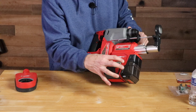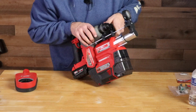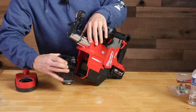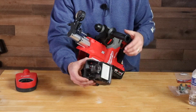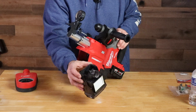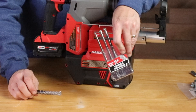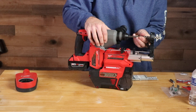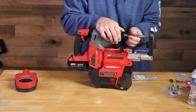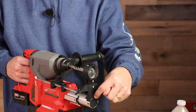When you're done drilling or when the collection chamber starts to get full, you can take it off — there's a port on there I'll show you. Right here is a port so you can hook up your HEPA vacuum and extract the dust, or you can shake this out into a trash can to properly dispose of it. The drill bits I'm using are Milwaukee four-cutter solid carbide heads. The bit locks in place, and this shroud works just like the other one — it takes the dust, pulls it in, and routes it into this collection area.